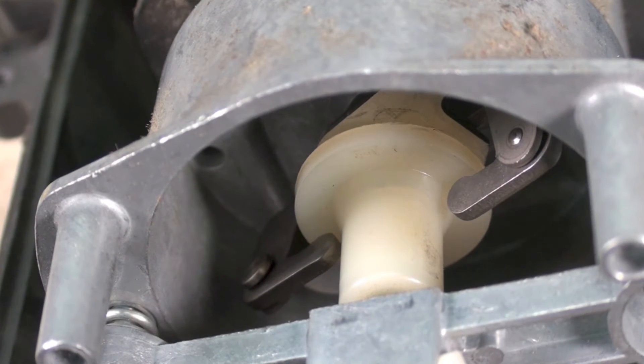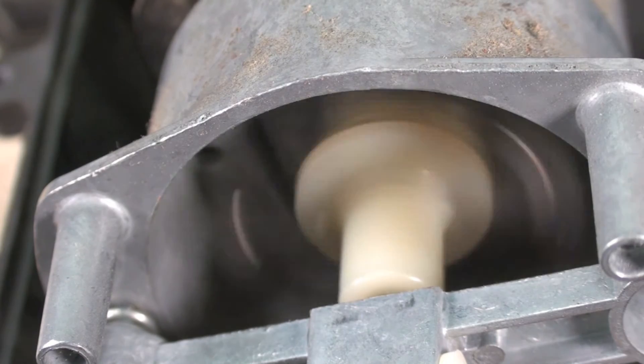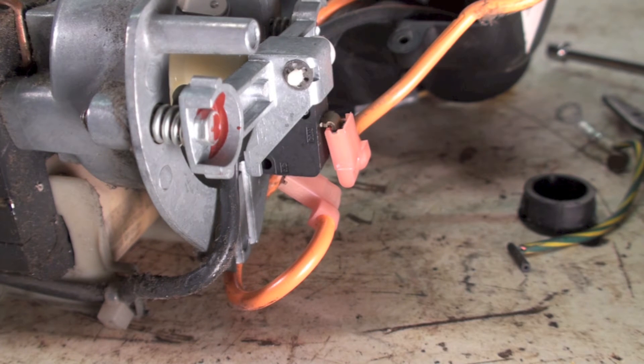I'll give you a little demonstration of it, and here it is in slow-mo. You can see right here this switch with the two wires — a little micro switch there, that's a little button you saw move in that last video. That's the way the centrifugal switch works on these things.